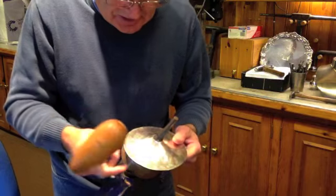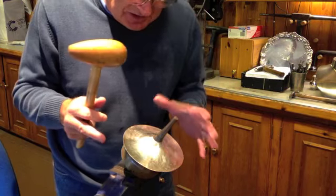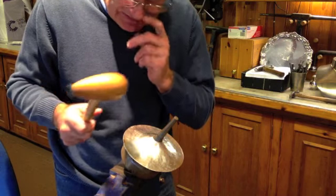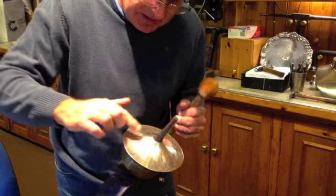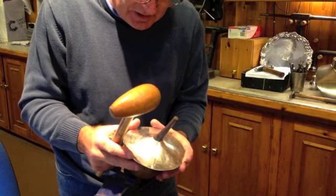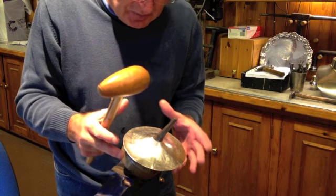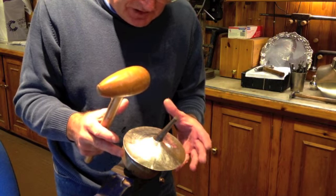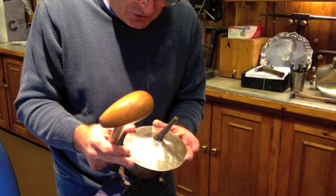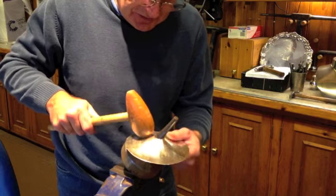With that annealing process, it's made it so easy now to get the correct shape. The beauty of it is that when you finish with the mallet, I'll then go with a very fine hammer that's slightly concave shaped to fit this, and the silver will go very hard again. It's important to leave the finished product very, very hard indeed. The tension is back in the silver. One of the reasons why, if ever the pieces of silver that you make get dropped, they won't get damaged. This is one of the beauties of it. So do a bit more here.